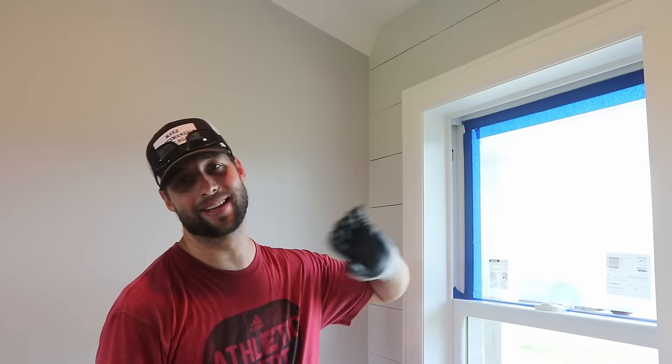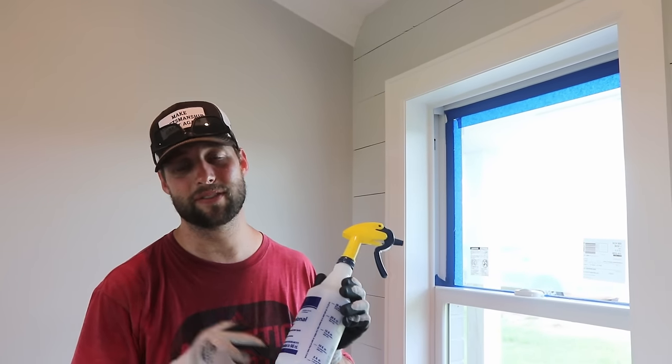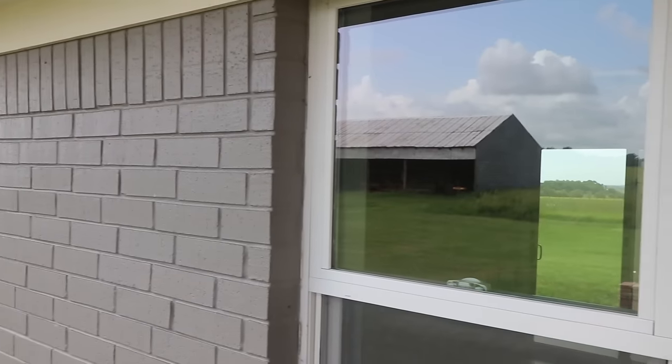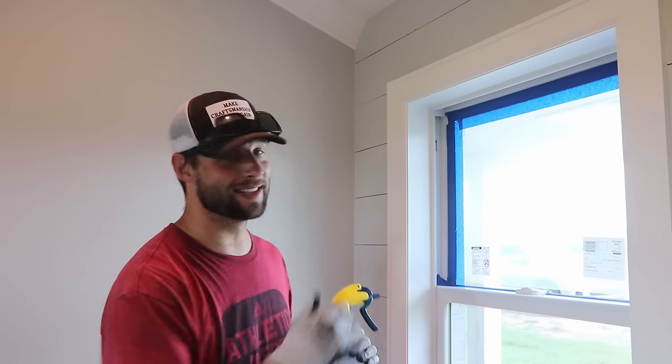Now we have new glass in our Anderson 100. I'm going to peel the masking off — that kept all the silicone from oozing out and getting on the glass, which is very hard to clean up. If you do need to clean it up, use a 50-50 alcohol and water mixture. You should also use this when uninstalling the glass — it helps loosen up the silicone adhesion. I totally forgot to use it when removing this window, and you saw it just cracked. So use the alcohol — it will really help. Comment below with your own tips. Subscribe if we've earned it, and we'll see you next time on Smith House.